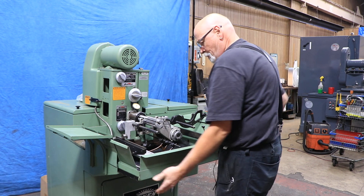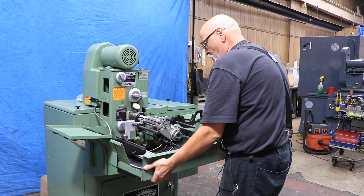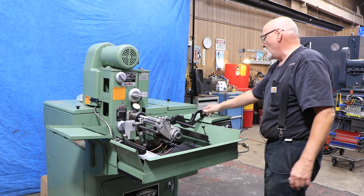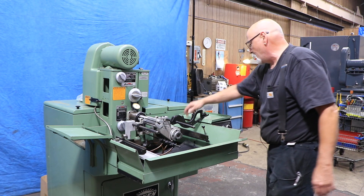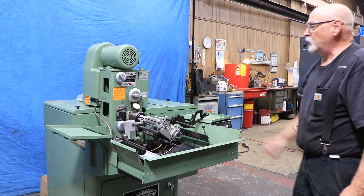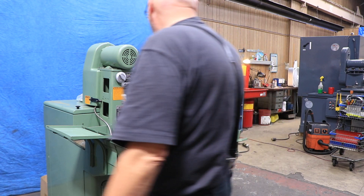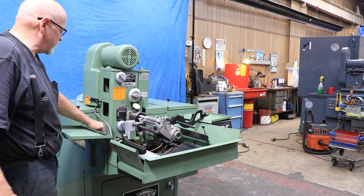You've got an adjustable work area here that you can pull in and out. You've got these side covers here you can move in and out. You've got an area here where you put your work pieces and they drain back into here. There's a built-in pump for the media, the honing fluid. It comes out these nozzles here and you can adjust the flow with this.